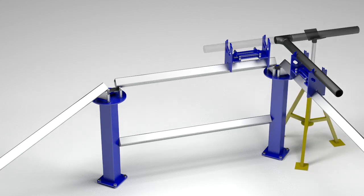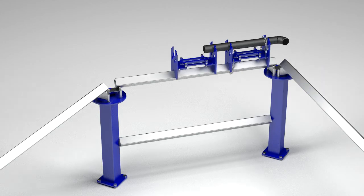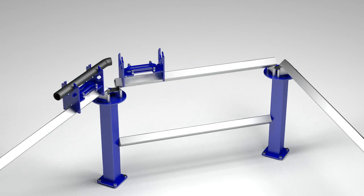The use of a traditional V-stand in combination with the speed rail will allow you to hold previously tacked fittings while you continue to make new perfectly square fits. The precision pipe fitting system in combination with the speed rail and stanchions is capable of making nearly any pipe fit.